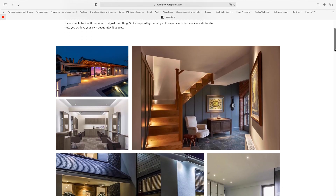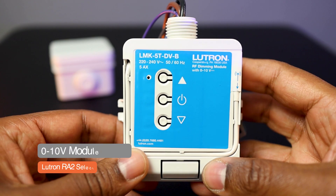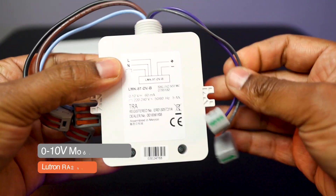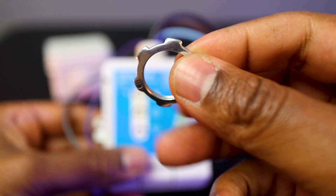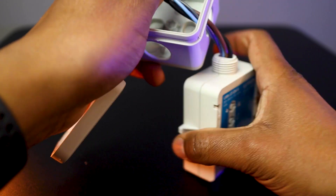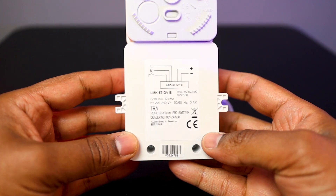If you are looking for light fittings for your next project, make sure to check them out — link in the description below. This Lutron 0-10V dimming module comes ready to be installed with all its cables and WAGO connectors. Its shape allows it to mount directly onto a junction box through a regular 20mm knockout opening, and if the opening hasn't got a thread, you can use the conduit nut provided. However, I would not recommend placing the whole module inside a metallic box or inside the light fitting. Once the module is placed on its box, wire it as shown on the back.